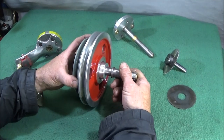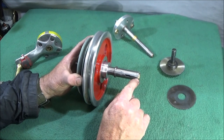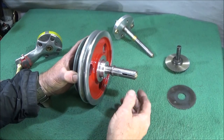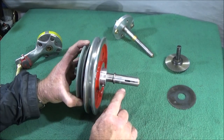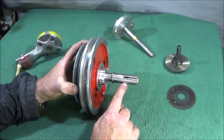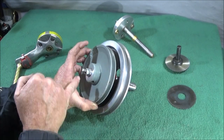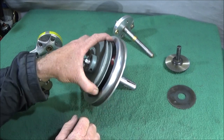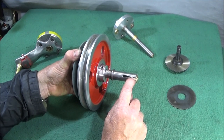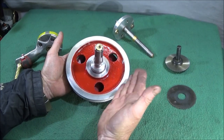The slitting saw can only go to a certain depth, so it's quite limited how much depth you actually get. I've been opening up the back end with an end mill on each slot, which makes the mandrel expand very easily and you need relatively little nut movement before it locks rock solid. But it's very time consuming, so I was thinking about what else I could use to speed up this process.